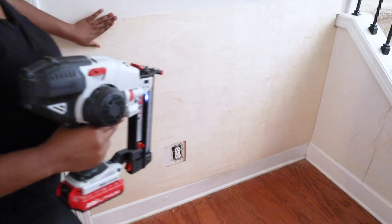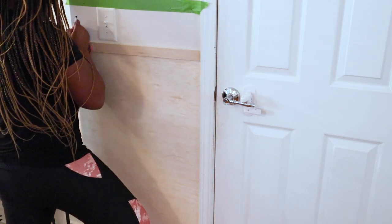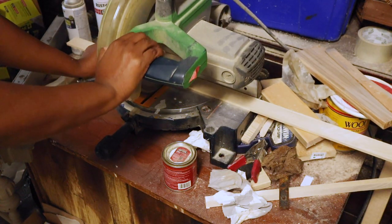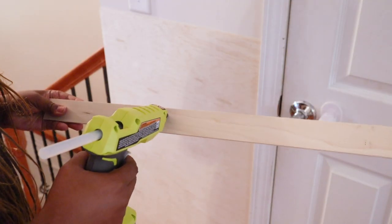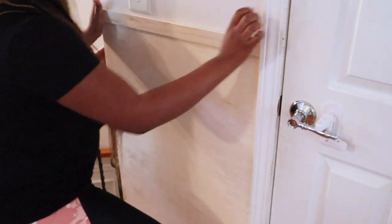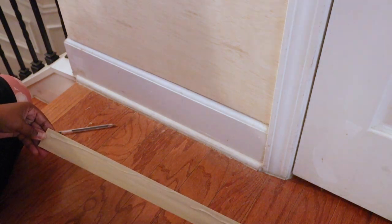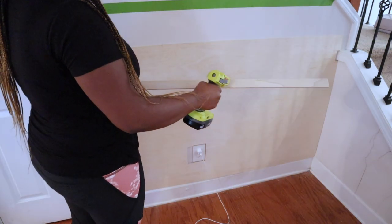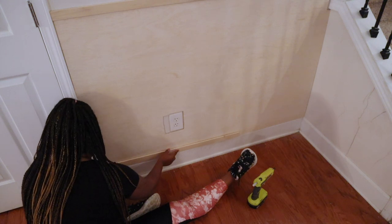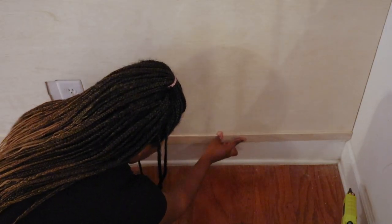I should have measured from the top and right side too to get the perfect measurement, but I knew I could fix it — I smoothed it out and moved on. Then I finally nailed the plywood to the wall with my nail gun. After the plywood was up, it was time to add my poplar boards. I marked where I needed them cut on the left side, took them to my miter saw, and cut the pieces. To keep it renter-friendly, instead of nailing these to the plywood I used my heavy-duty hot glue gun with Gorilla glue sticks.